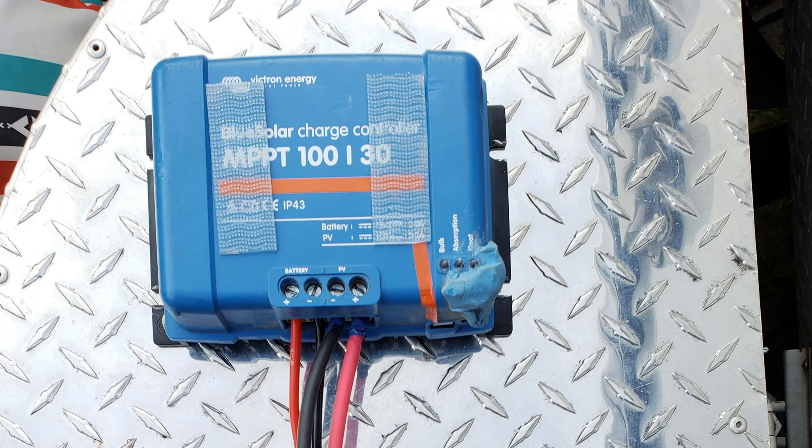Another thing people often ask about when it comes to solar panels is: if I have a portable panel, how do I secure it? Most people will use some type of chain and lock. I use a cable lock, and I'll put a link for that in the description below. Your solar controller selection should be something that works for you — you want to make sure it's the right size for your solar array setup. The choice you'll have to make is whether you want an MPPT controller or a PWM. PWM is the older technology. I've always chosen an MPPT controller because if you're running more than one panel and run them in series, it will charge faster.